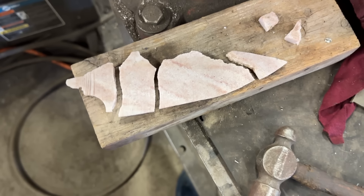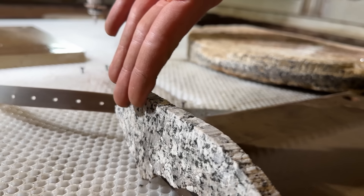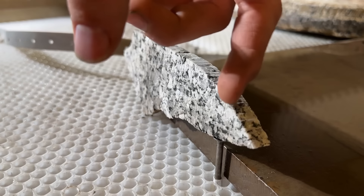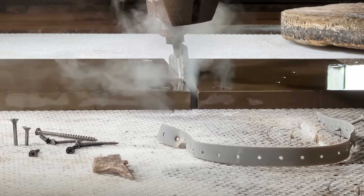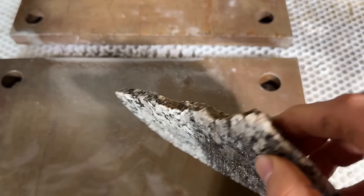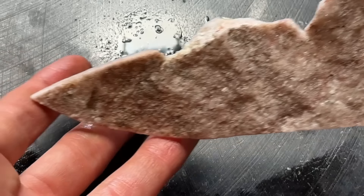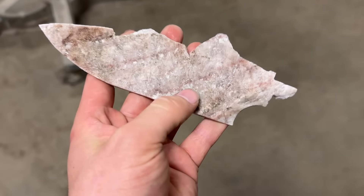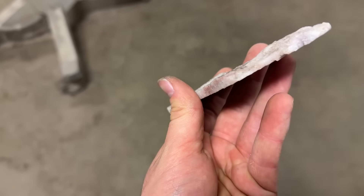Here are each of the pieces — I can't decide if I want to try to glue it all together or completely start over. Back to the granite knife: if I keep this nice and straight, bring in the water jet head at a slight angle and go along here, that should give it the same angle even though this is a curved knife. How did the blade turn out? That is usable — I really like the shape we have going on here. So I'm going to glue it and hope it's not a nightmare. The old super glue trick — no visible seam. I actually really like the rock pattern on this side rather than the cut finish, so maybe there's a way I can preserve that and just come in on this side with the water jet and give it a nice edge.